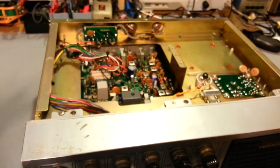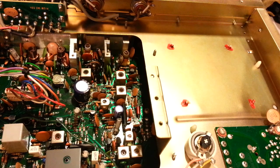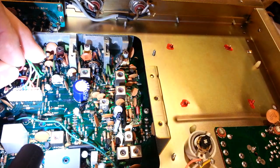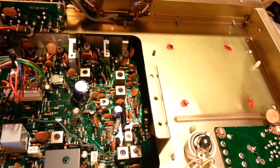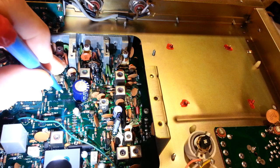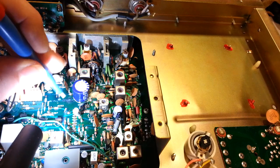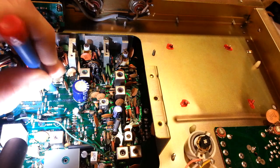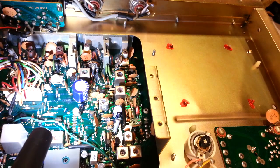We can investigate that together — I always hope not. It's not that I don't like doing them, but... I think I see — yep, I see corrosion. Let me get a flashlight. Yep, it's leaked. They almost always leak in these things. As long as the corrosion's not too bad, I'll be able to just clean it off and put some epoxy overcoat over top to fix the traces. You can see all that bubbled overcoat on these traces — this capacitor has leaked. You can see how dark it is underneath. It should be this nice light-colored green. That's because the copper foil underneath that epoxy overcoat is oxidized.